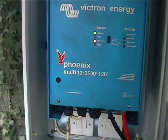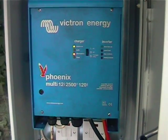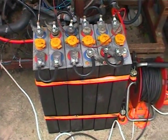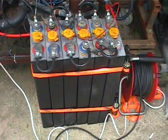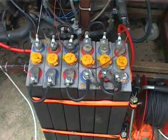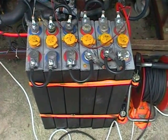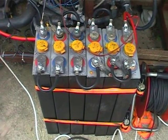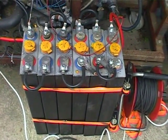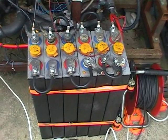You can see it's a 12 volt 2.5 KVA inverter and a 120 amp 12 volt charger. At the minute I have it charging this bank of 6 forklift traction batteries — 6 two volt cells that I got out of a scrap forklift traction battery. I managed to save 7 cells that were still at around 2 volts each, and I picked the 6 best out of that 7.